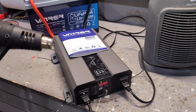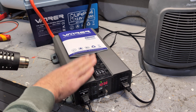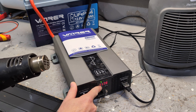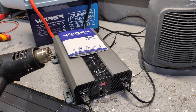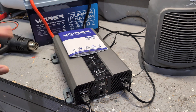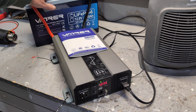I just turned the heater on and we are already pulling 1192 watts — exactly 100 amps out of this battery. I'm going to add another 700 watts, bringing it to 1800. It reads 1796 watts, and there it is — the BMS on the battery just cut off. It lasted for about seven or eight seconds and then cuts off to protect the cells. It just came back on, and that's a safety feature built into the battery to protect the BMS and protect the cells.